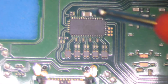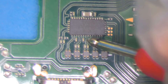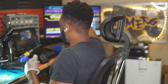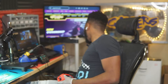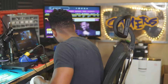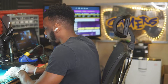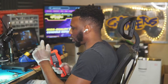Here's our P13 chip right here, and we have no short from this P13 chip at all. So no obvious shorts, nothing that we can see. My other choice is to be able to take my thermal camera. I'm going to plug this thing into power and we're going to put some voltage running through the board and see if anything gets hot.